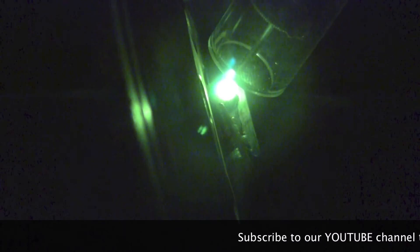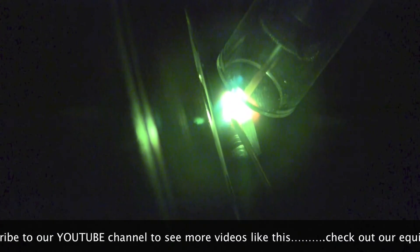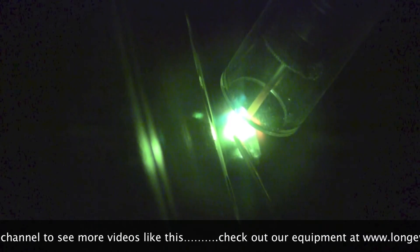The first side filled up real nice — it was a little bit smaller than the second side. Once it cooled off I flipped it over and got prepared to weld up the second side. The first pass didn't quite fill it up, so I put a second pass across to make sure it was full and flush. I didn't want it to come back from the machine shop underfilled, so make sure you fill it up completely.